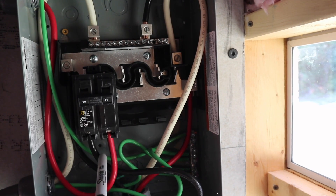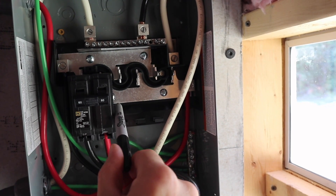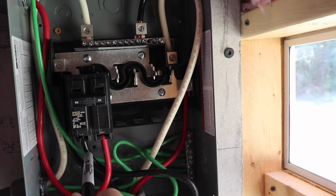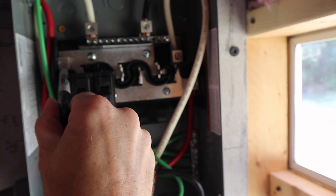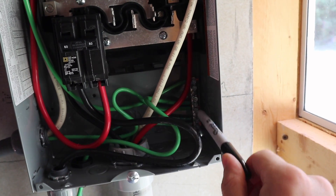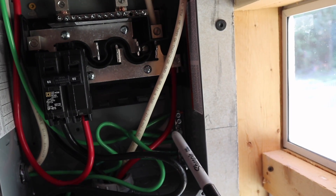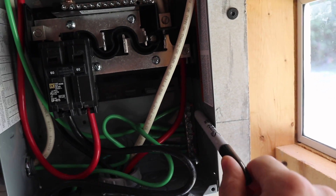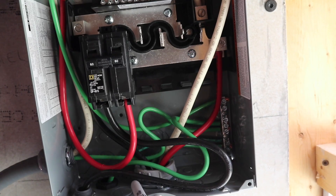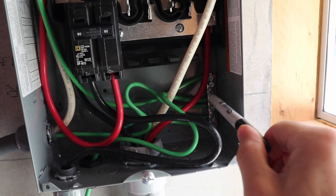All of our neutrals land on our neutral bar at the top. We had to buy larger lugs for this four gauge wire, so we've got the neutral in from one inverter and the other inverter, and this is our main neutral going back out to the barn. We've got our two conductors coming in from our inverters — black is on this side, red is on this side — which means this bottom bar is connected to red going back to our main service panel, and this black on this side is connected to the top, which is connected to the black going back to our main service panel. This is a sub panel so nothing is bonded, meaning there are no neutrals that touch the grounds here — that all happens back in our main panel. All these grounds are from our inverters, the one back to the barn, the one in from the MPPT, and also the electrical grounding conductor in from our panels is connected here as well.